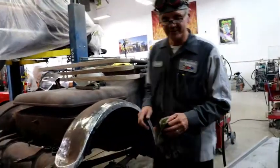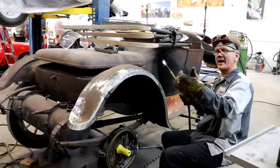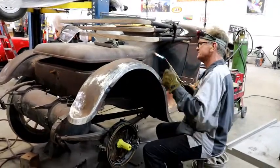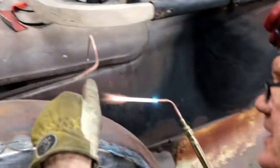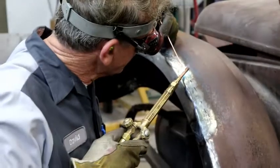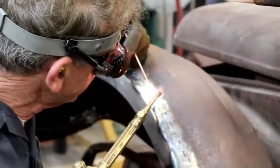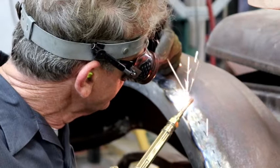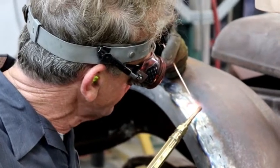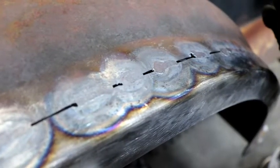Alright, wire hammer welding — using wire and not a TIG welder, but actual gas welding wire. I'll go through the process. Here it goes: bring it up red hot, it begins to melt, and you run short feed — sometimes longer, sometimes shorter. I'm doing about an inch here; normally it's about a half an inch or so.